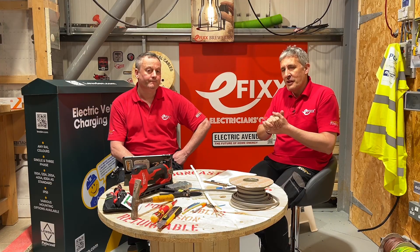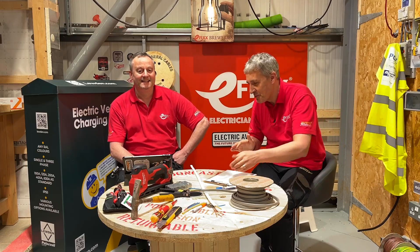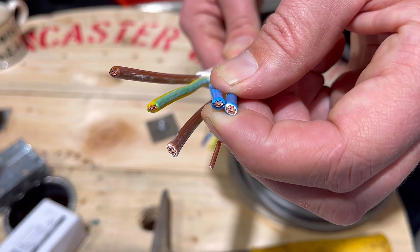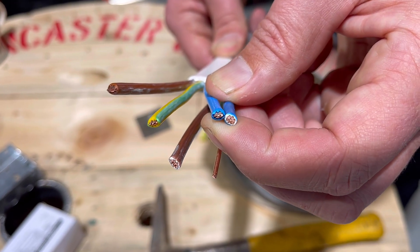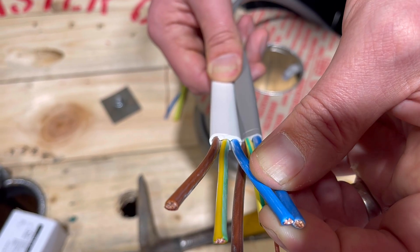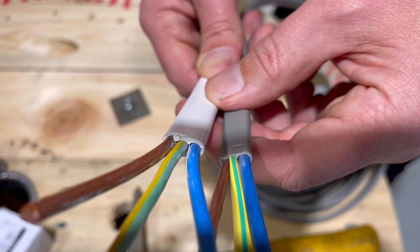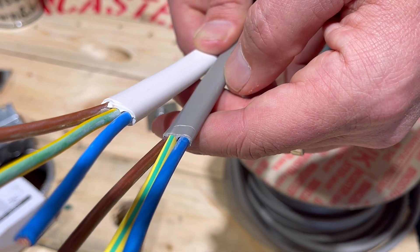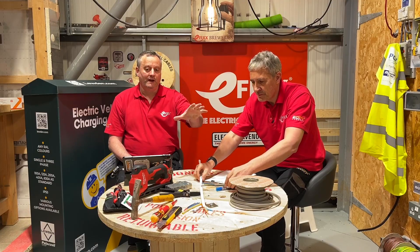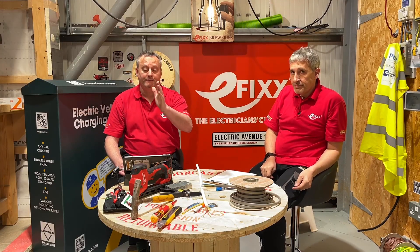People might think that extra wire is going to add some additional dimension to the cable — it might do in the 25mm one since that doesn't exist at the moment. But comparing a conventional 6mm cable to the existing BS6004 cable, they are very dimensionally similar because the insulation on the inner conductor is XLPE, which is actually a little bit narrower. So when you add that across the cable it doesn't make a huge difference. Now — jumping straight to the comments — we've gone to XLPE, which means we've raised the conductor's operating temperature to 90°C from 70°C before.